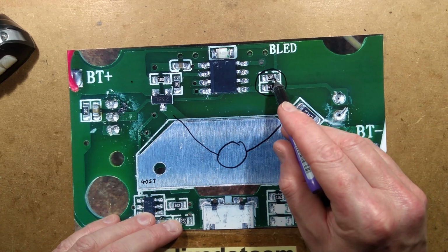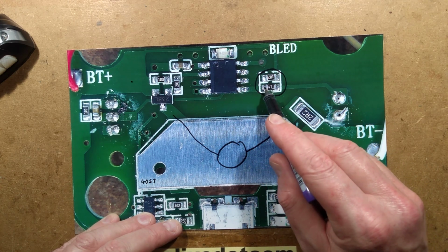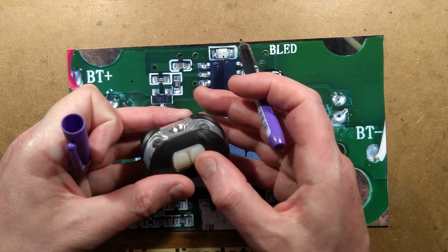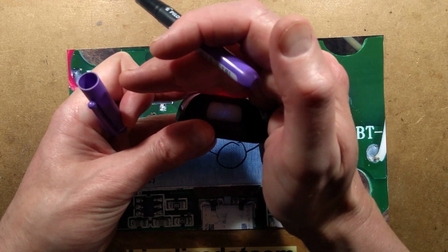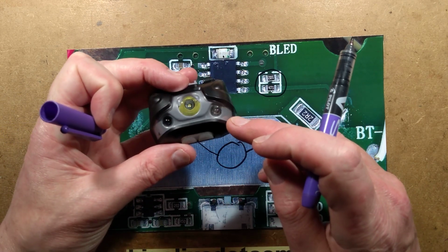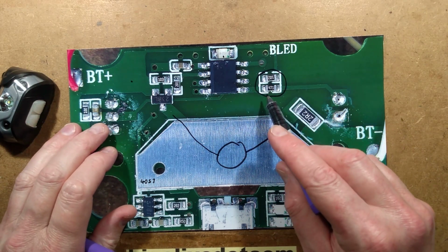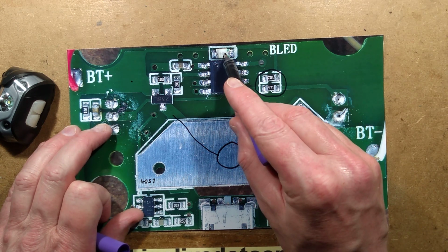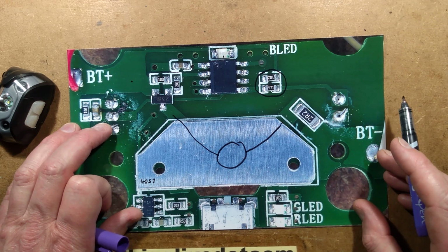What caught me out there was this 1K resistor, 102, going up to this LED, which is underneath this cover, and it shows when it's in automatic mode. If I click the left hand side, you may just see the slight blue glow on the top of that, and that would be matched by the infrared glow from there. The reason it's doing that is it's just the easiest way. It means one pin is pulsing the infrared, but it's also pulsing this little blue LED at high frequency. It doesn't matter, it's just making it glow so you can see it's active.